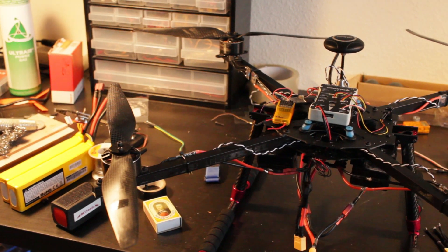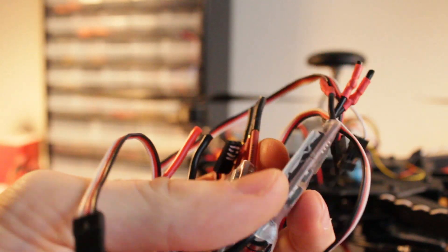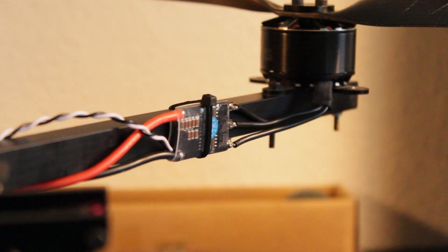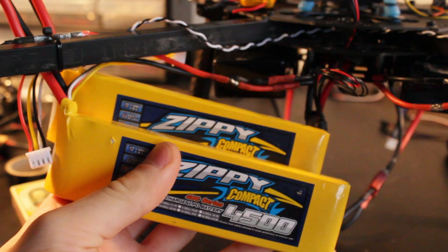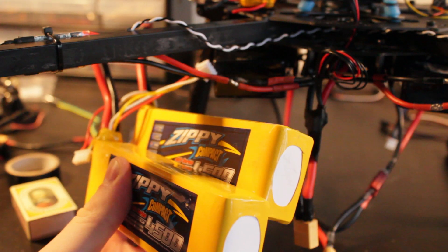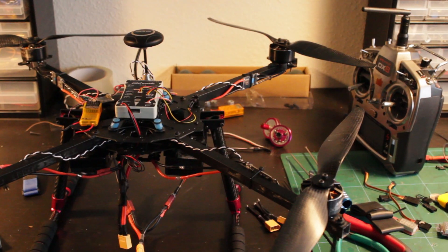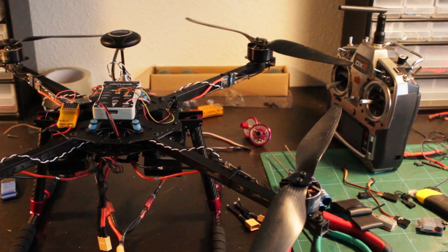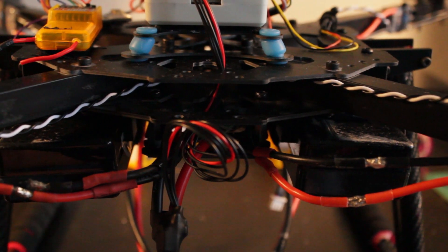The first thing I did was to replace all the ESCs. The other ESCs had gotten really old and some of them actually burned out. Therefore I replaced them with these Multistar ESCs, which can take 2–6S and 30 amps. I really wanted to run the drone off a 6-cell LiPo, but the drone is so overpowered that it simply won't fly — it just takes off like a rocket. So instead I will be running it off two 2-cell LiPos in series to create a 4-cell LiPo.